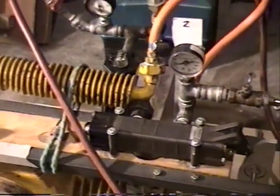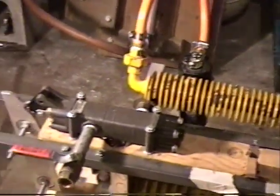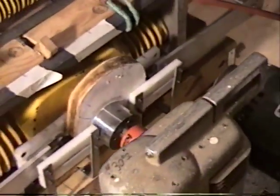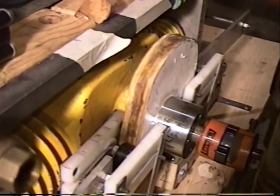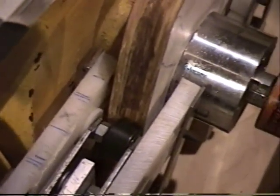It's November 16th, I think, Sunday, about 9:15, 9:20 p.m. And I got the engine working pretty good. I coated the edge of the cam with epoxy, because that other cam follower was gouging into it, and I replaced those cam followers with real ones from the parts store.